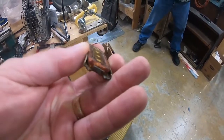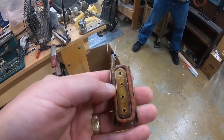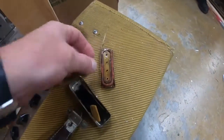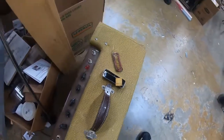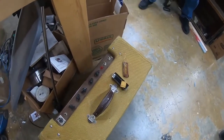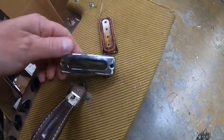It's a rather unique way of winding a coil. What does microphonic mean? It means that if you tap on it, you can actually hear the tap coming through the electronics. Which is not good, because it wants to feed back easier — it's more vibration prone. Wax potting or varnish potting dampens the microphonics. But some folks say that it takes away from the sound of the pickup.